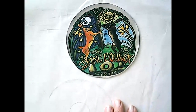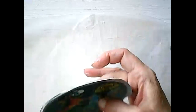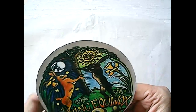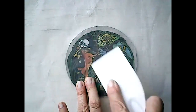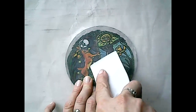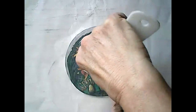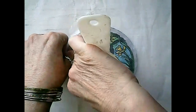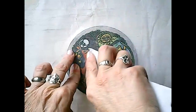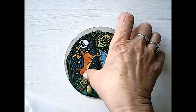I'm going to take this wax paper and just kind of look around — you can see there's a bit of an edge, but that's fine. Just make sure everything's on good. I'm going to take that wax paper and burnish through, starting at the center and going outward all the way around to get out any air bubbles. I'm not going to trim it up until everything is dried well, which doesn't take long. I have a wet rag here to clean up anything around the edges.